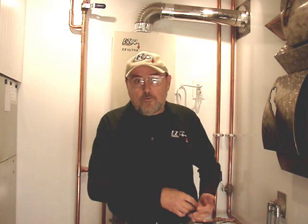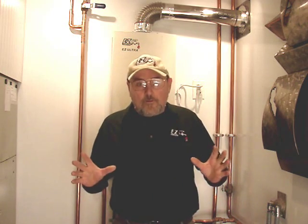If it's for whole-home use and you want the shower to have a consistent pressure, you need to regulate the whole house — meaning the regulator is placed earlier in the system, before it splits off to hot and cold. The reason is that when you're in the shower and the well pump kicks on and off, you want your pressure to go up and down equally, so that when you have hot and cold blended together, even though the pressure is rising and falling, you have no change in temperature.